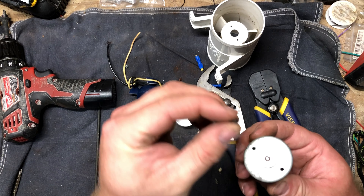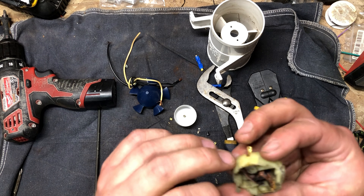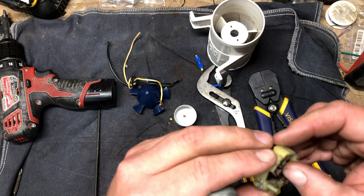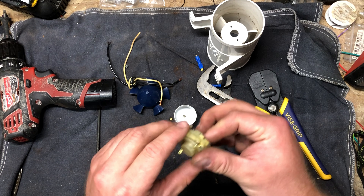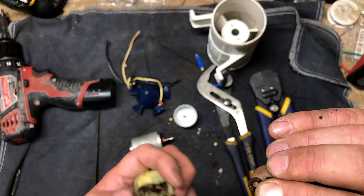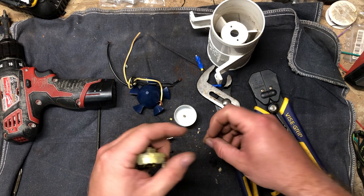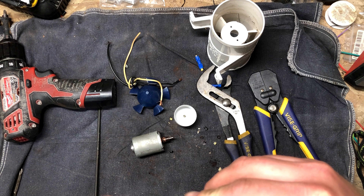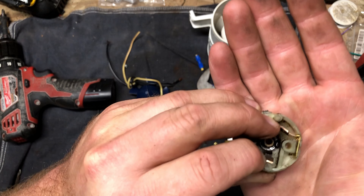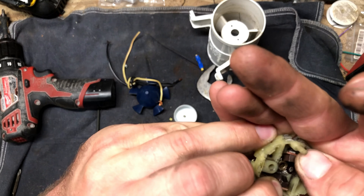That was actually kind of tricky to get apart. We've got what appears to be a little rubber seal on the top — I had to cut where those little tabs were to get this apart. We've got the rear brushes, and interestingly they made the springs out of copper. Plenty of brush material left on there — this thing was just making noise. In the back we've got what appears to be some shims, looks like an acrylic with a fiber weave — insulative, to prevent any potential arcing to the rear. There's what appears to be a brass bushing back there, held in a punched metal casing set in what feels like nylon plastic.